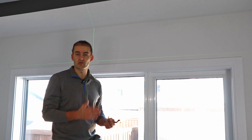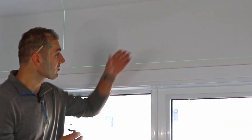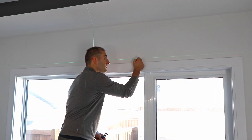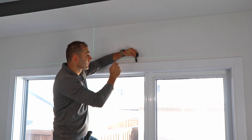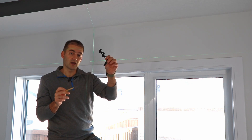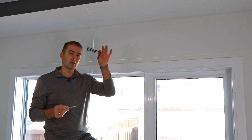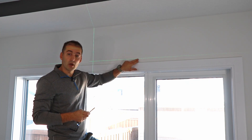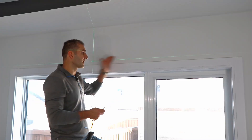In this case the curtain is 84 inches long and I want it a couple of inches away from the floor, so this is approximately where the curtain will sit — that's exactly where I'm making my first mark, where my bracket will sit and where I'll drill the first hole for my anchor. This curtain sits on three brackets: one on the left, one on the right, and one in the middle. I don't need to make three separate marks because I already have one mark and a self-leveling laser giving me a perfect level line across the window.